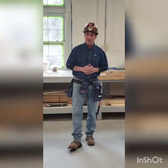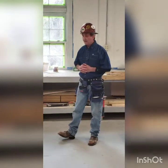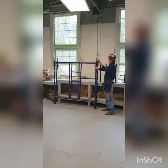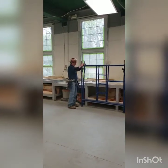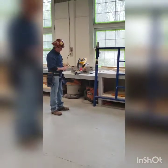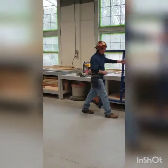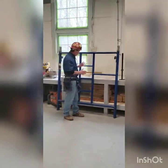First I'd like to start out by identifying our components and making sure that they're safe to use. These are our frames right here. What we want to do is make sure that the boots are all locked in before we start. At the bottom where we're going to put our screw jacks, we want to make sure that those are clear from debris, not dented, not rusted out. Same with our welded frames — we want to make sure there's no rust, no dents, no turns in them.